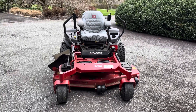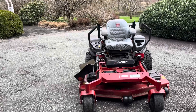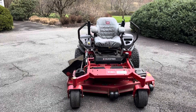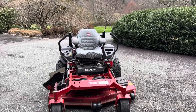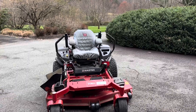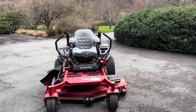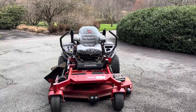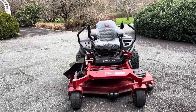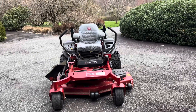As the mower blade spins, it pushes the air in front of the blade out of the way, creating that partial vacuum or low pressure zone. It's absolutely essential that the mower deck is able to control the air being pushed by the fin of the blade in a consistent manner, otherwise it won't maintain a good low pressure zone behind the blade fin. Without that low pressure zone, you won't get the lift action where air from outside the deck rushes in to fill the void left by the spinning blade.